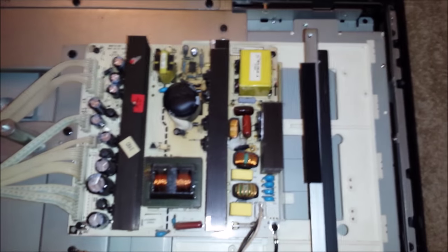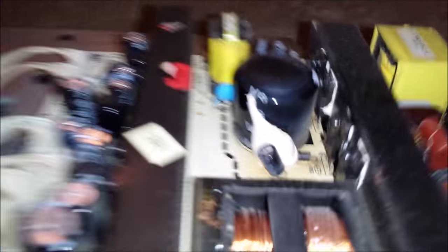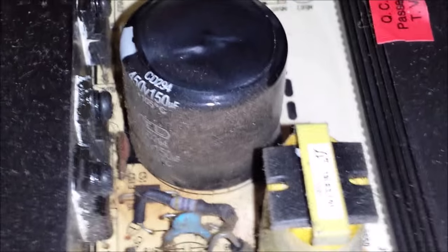Because this is actually a very nice 40-inch television. Let me get the back off and we'll see. We're in — 400 screws later. And I am willing to bet this capacitor right here is going to be our problem. She's all wavy on the top. Now, one concern I do have is we're looking a little toasty in this department too. I have that capacitor somewhere, so we're going to do an attempt to repair here, but just for grins, we're going to turn it on.